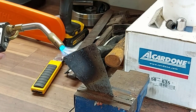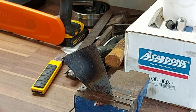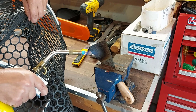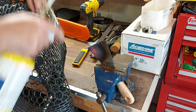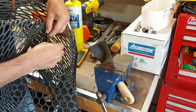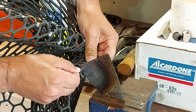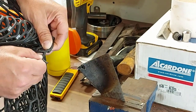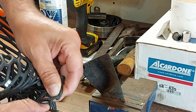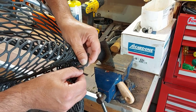It doesn't take a lot of heat — heat up both sides. You can see that scraper metal is getting red hot. I'll heat up my scraper again. Okay, it's good and hot. I've got the two joints on the net that I want to stick together. I'm going to bring the net like this, put these two here, go like this on each side. You're going to see it melt and smoke really quick. Stick them together — try not to breathe in that smoke. Now we're going to hold this for maybe 20 to 30 seconds. You can see the nice rubber bead in there. You melt the rubber together and it holds really good — I can't believe how strong it is.